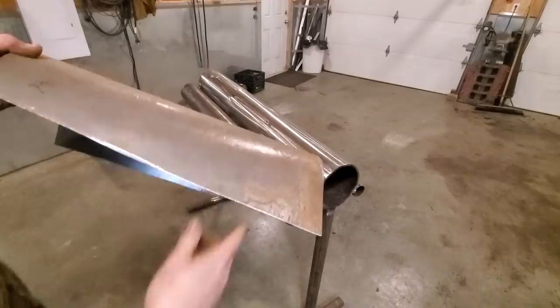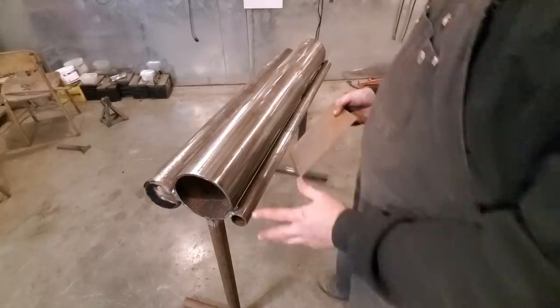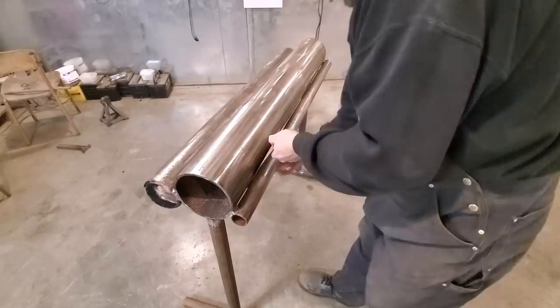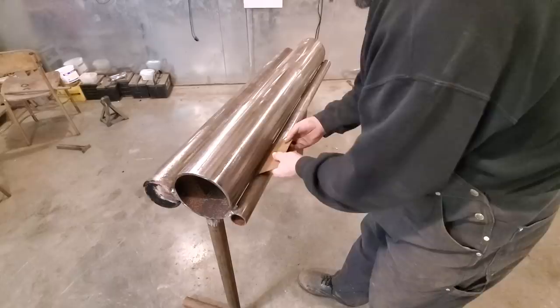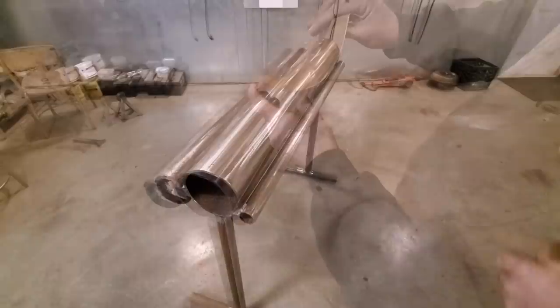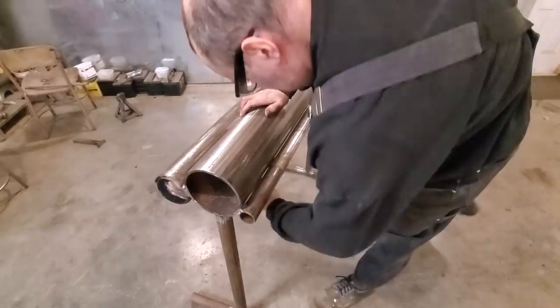Now sometimes you'll have like a bottom of a quarter panel that got a roll or a rocker panel or something like that on it. This is just a small sample of it. I went over to break and I bent it in a 90. Bring this up through this way here. Hold that there. Now you got a nice contoured rolled edge for like a rocker panel. Sometimes you might just want a full large bend. Fold it right over and get yourself a nice loop bend.